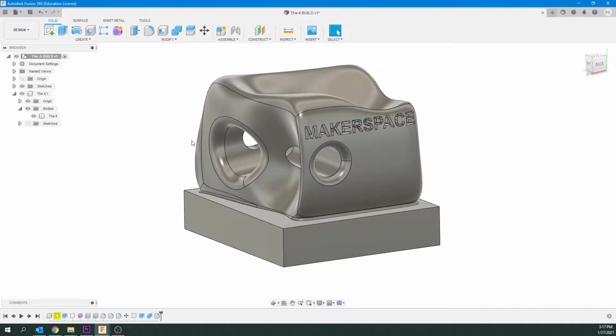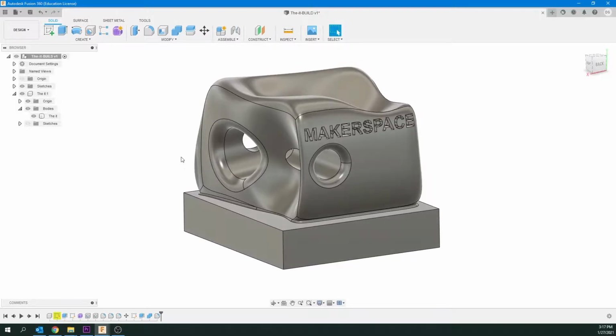But quite often, you're going to want to cut your object away from the base. You do need a base for the Pocket NC that gets fastened into the vise, and you can't tool into that area because it's the area where there's set screws and that kind of thing. So what you would usually do, where the object meets your base, you would do a machining operation where it cuts out a lot of that, and then you would probably just hand saw it at the end to cut your object away from the actual foundation.